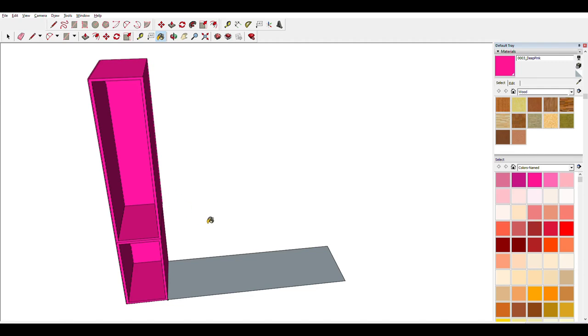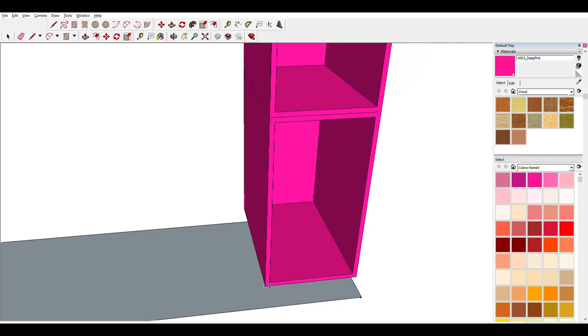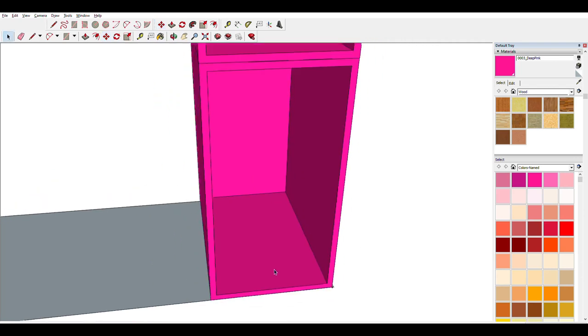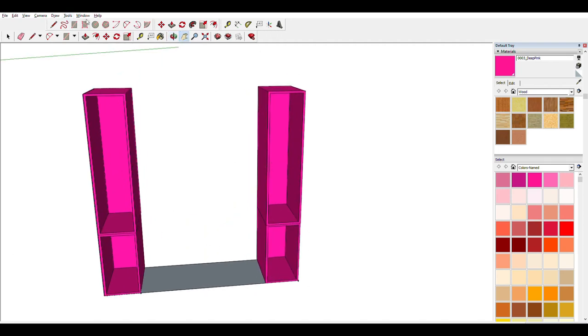Okay, now I know that I can do the same thing over the other side. There are lots of ways you could do it, but the quickest way now is I will copy these two items and I'll just come in over here 6 mil. I don't need to put the end panel in because obviously that's going to be against a wall. So I'll just come in any measurement, click it, and then type in the 6. I often find it's easier to do it that way than to try and find the 6. Paste that, and then make sure we select that corner, and it should snap to my guide point. You could have come over here and then moved it over 6, but I just find it's easier to put the guide points in. It gives you a visual, I suppose, as well, that you're aiming for. Now I've got these two box sections either side, I can measure between them. So in this instance, we've got 1430.